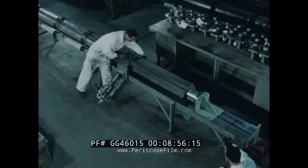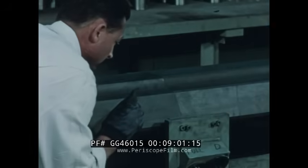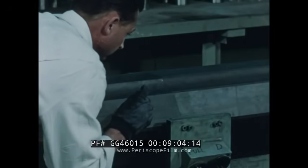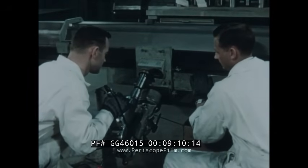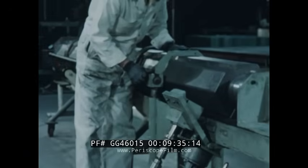A horizontal graphite loading jig facilitates final assembly of the moderator elements. Three graphite blocks comprise the moderator element for each can. A graphite indexing plug at the junction of adjacent blocks prevents rotation. The total weight of the complete canned moderator assembly is about 760 pounds. After loading, the top cap was welded in place and x-rayed, and the complete moderator unit given a final leak test.